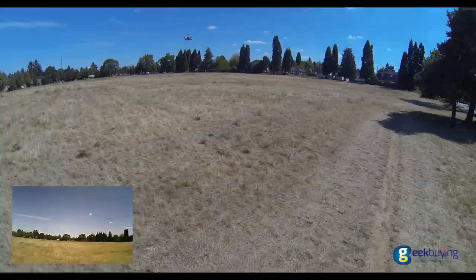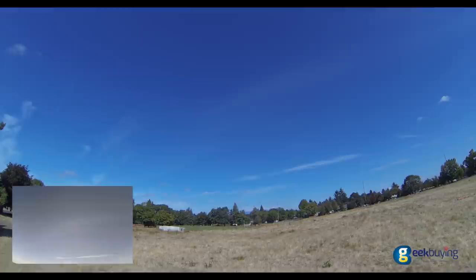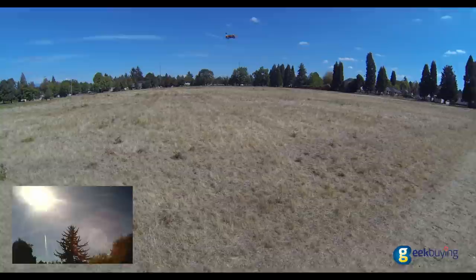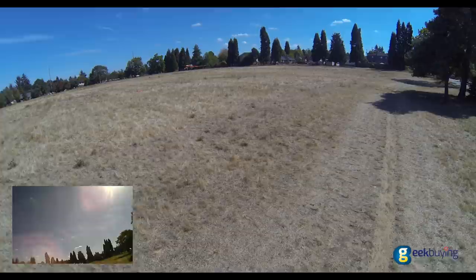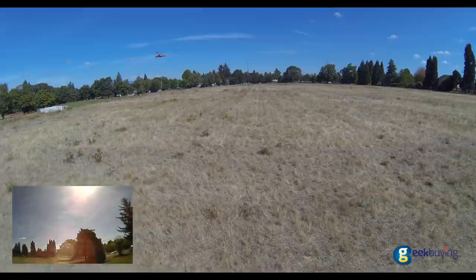You don't have to go super extreme or HD or anything. It's oscillating a little bit so I do need to PID-tune it a little more, but with the second round of PIDs it seems to be doing pretty well. I had no crashes or any system malfunctions — nothing went bad on me. So it's a nice quad if you don't want to build and just want to jump right into practicing racing. It's a little more expensive than some other ARF quads, but it's worth the price because you get a lot of what you'd already want — larger motors, 4mm bottom plate.